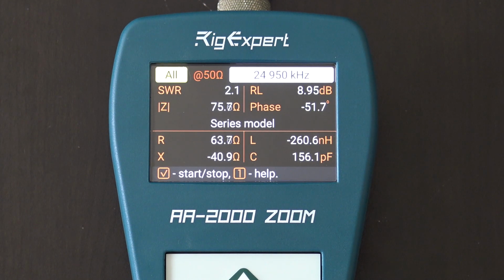But you can see in real time, that shows you a lot of information on your antenna on what's happening. And that may be useful for matching stubs or matching networks, maybe using it for traps. That may be very useful if you're building your own antenna. Gives you a lot of information there that's useful.